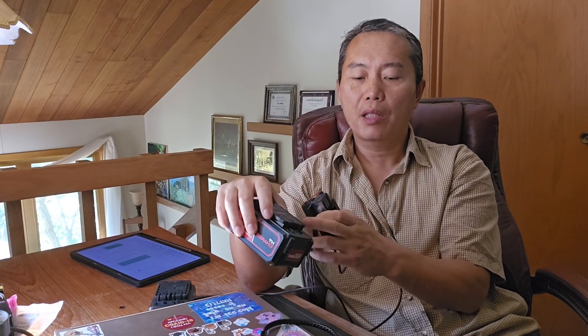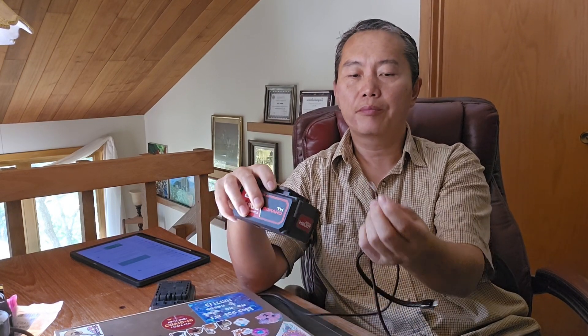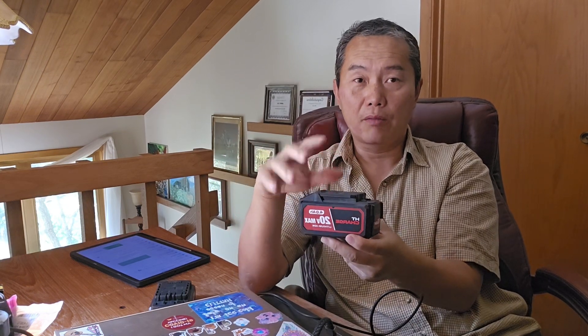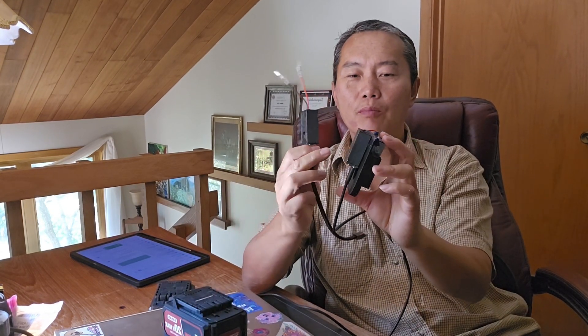This is important for safety: if you plug in the wrong direction — negative to positive and positive to negative — you'll not only burn out this charger right away, but also damage your battery. In DC, if you mess up the polarity, it creates a short circuit and you'll short your battery. That's definitely not good. For a secure connection, use my charger with my battery adapter.